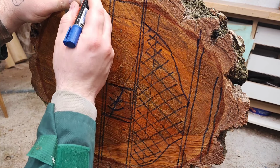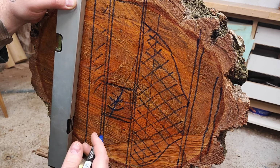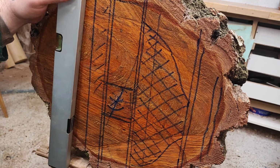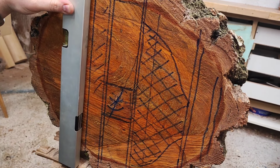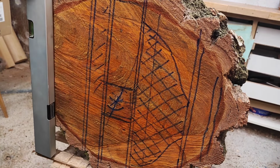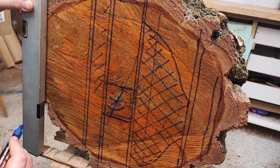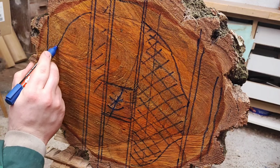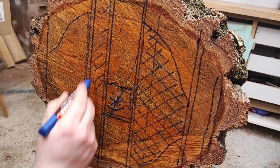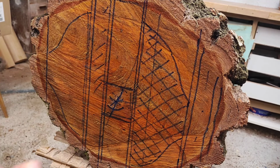And here I'm going to do a platter blank. So this blank here for the platter is not ideal. You want to have a quarter sawn, but this is close enough for this size of bowl, so I'm just going to leave it as it is. And here I need another curve, and here we just make the maximum. Let's go to here. So we have two bigger bowl blanks, a platter blank, a little board here, and another bowl, and potentially boxes or anything like that.